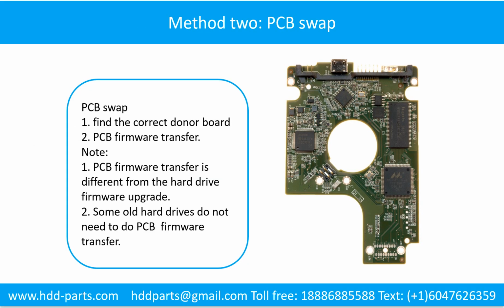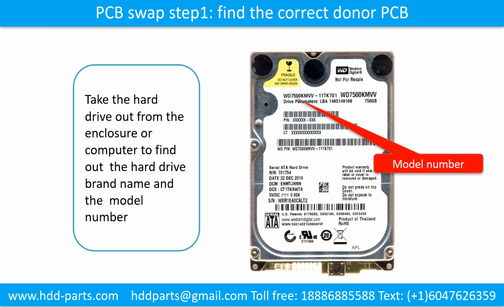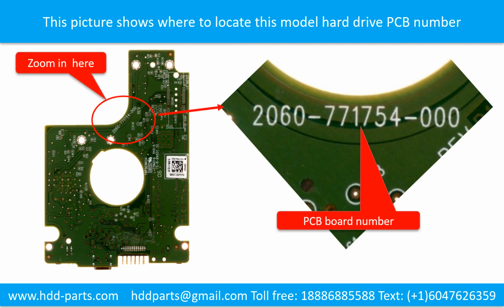Method 2. The printed circuit board swap. PCB board swap. Step 1. Find out the correct donor PCB board. Locate the hard drive model number on the front of the hard drive label. Locate the hard drive PCB board number. Different brand name, different PCB board. The PCB board numbers are different.